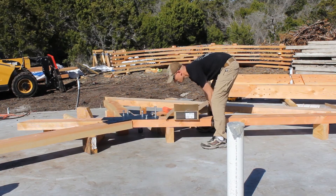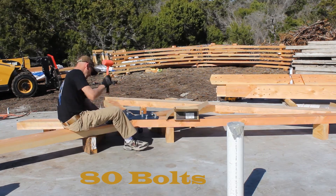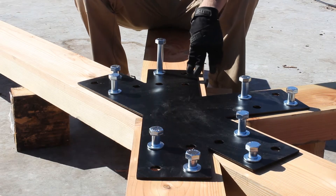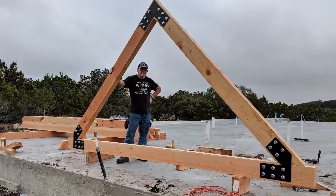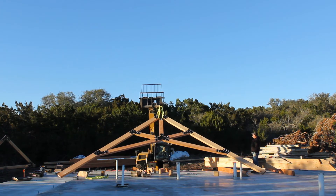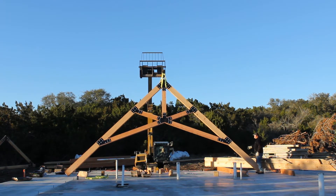The process of pounding all these bolts in and sticking things together just continued. The big trusses have around 64 bolts each — a lot of damn bolts. Once they were all put together, we stood them up. Then came the next problem: where do we put these things now that they're complete? My original thought was to stand them up on their ends like they'd sit in the house and brace them with two by fours. That wasn't going to work. The first little one off the ground is nine feet, and that's tiny compared to the others. We took the first completed scissor truss and stood it up — it was towering above the trees. No way were we leaving that standing up in the wind with the majority of the mass up in the air a good 10 to 12 feet.